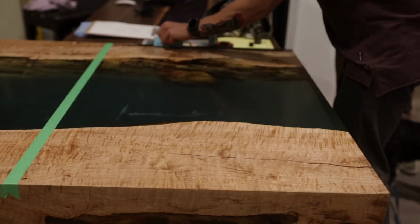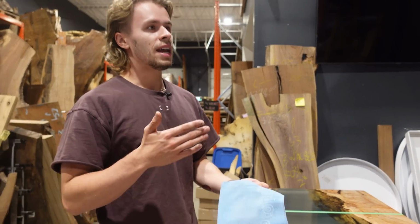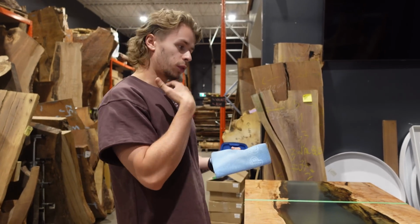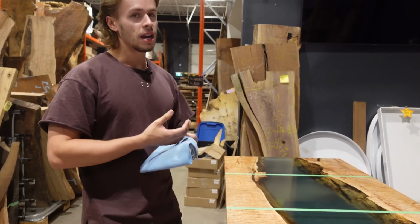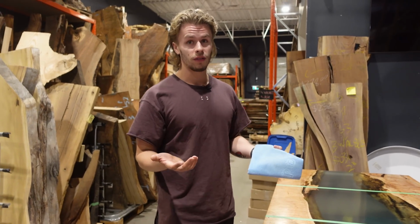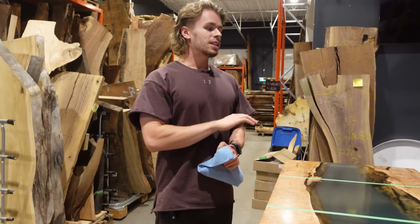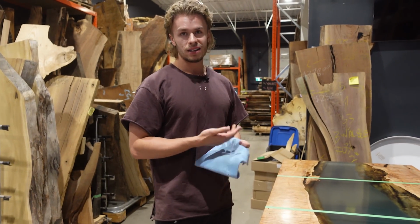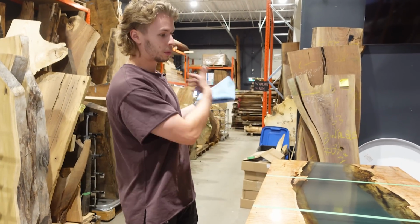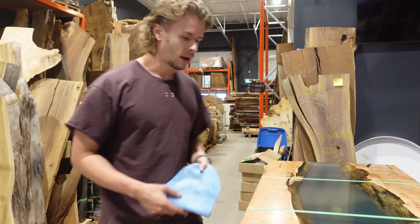So please be careful if you're buying a ceramic to put on your projects, especially the lower grade ceramics that are less expensive. The reason our solvent-based ceramic worked is because mostly what was in there was the protectant. There wasn't a whole ton of solvents, and we had a very high percentage of protectant, whereas in these cheaper products, it's a very low percentage of protectant and just mostly solvent. If I did this on this table, it would just completely strip away all of this finish. So do your research and make sure you're using the right product.